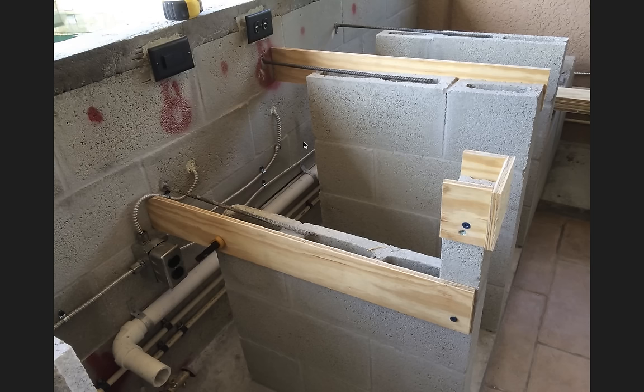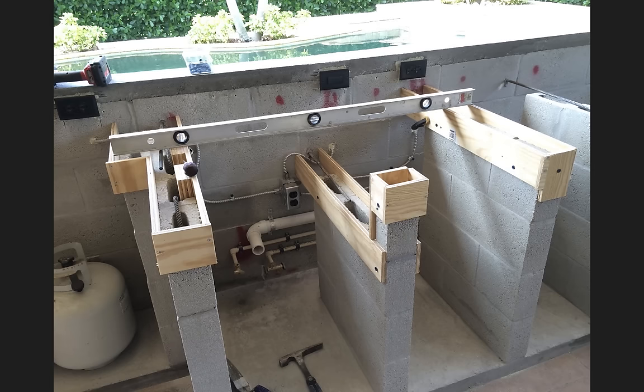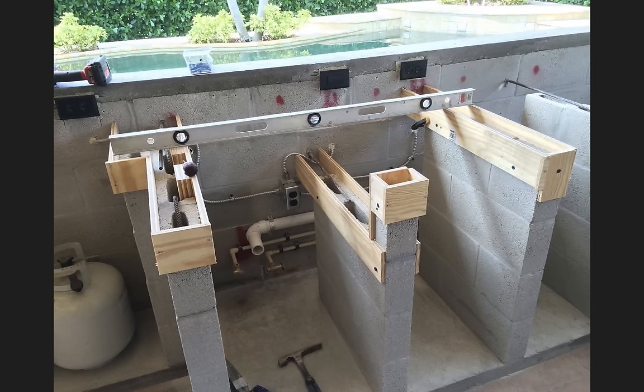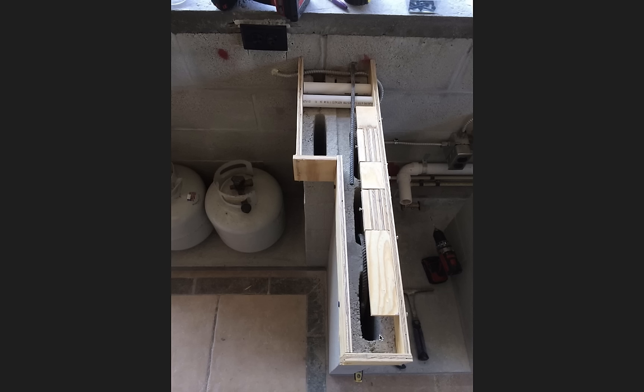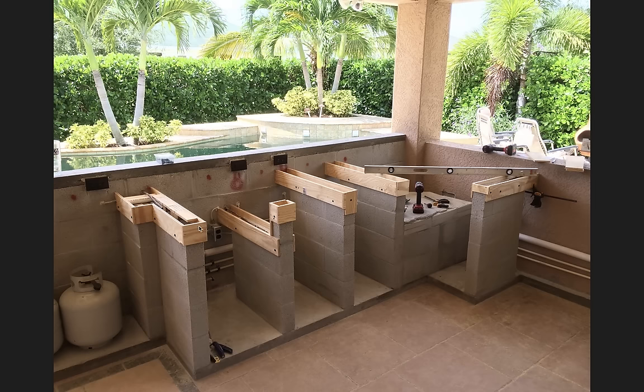Here I began to form out the tops of each of these walls. I had to create a little bridge to pour concrete so that the top of the wall was anchored into the back wall, but I still had this big opening — just a little extra work, but it turned out pretty easy. Here I had to put in a spacer to block the concrete to handle the sink. The sink literally goes from a quarter inch from this wall all the way to a quarter inch from the side of the ice maker, so I needed to jog this wall down and leave a lip in order to get the sink in there later.